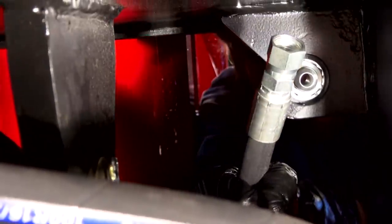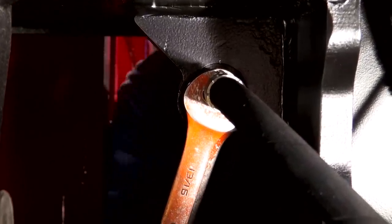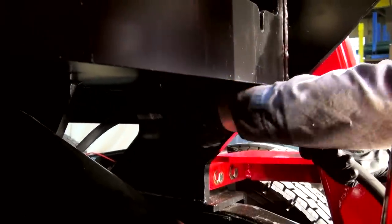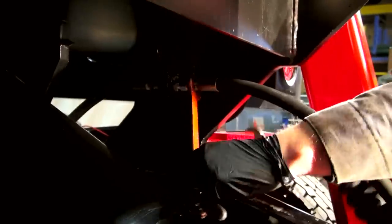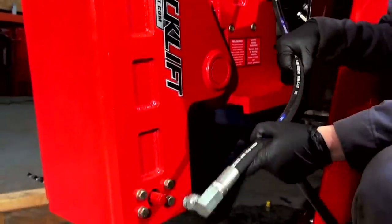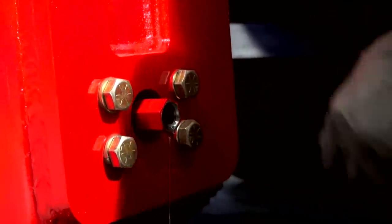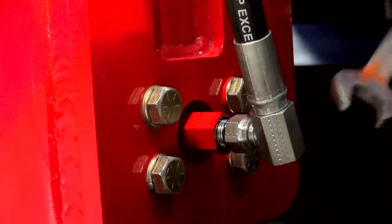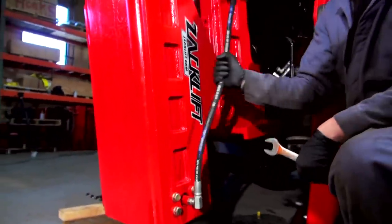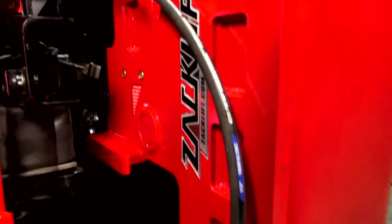When you've completed hooking up your tilt cylinder, you'll then move to your extend cylinder. You'll run from your bulkhead fitting on the back of your toolboxes to the bulkhead fittings underneath your beam — these are located on the driver side and passenger side. The lower horizontal cylinder will have a cap on it; when you remove this cap, it's a good idea to have a drip tray handy. Connect your swivel fittings to your lower horizontal: the number three hose is on the passenger side for pressure, and the number seven hose is on the driver's side for return.